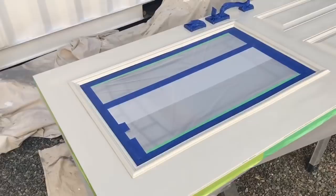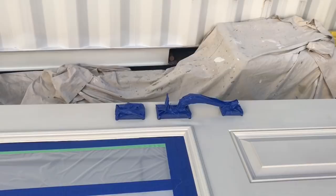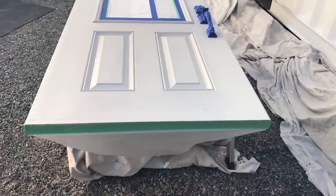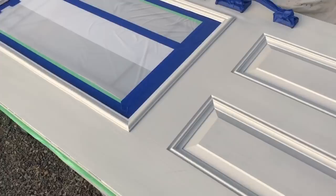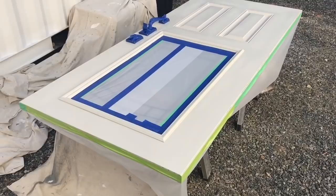As you can see I've got this door all prepped. I've left the hardware in place and I've just left the tape up about an eighth of an inch, maybe 3/32nds or something — got everything masked off. I gave it a light sand just to take out any of the blemishes that may have been in the door. It's important that you have your work surface prepped and everything is ready to go when you go to spray, so that you're not running into any hang ups.